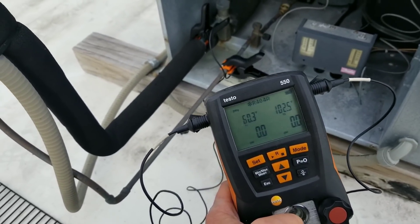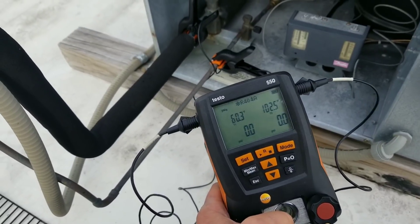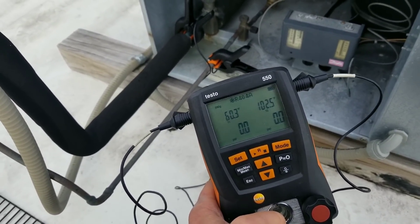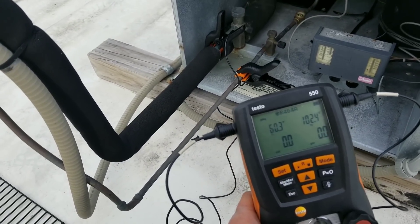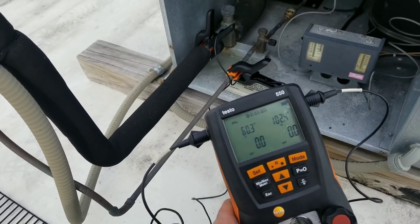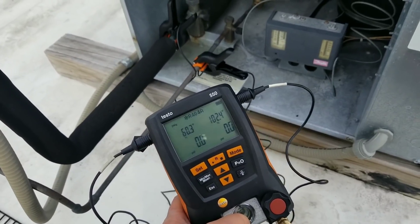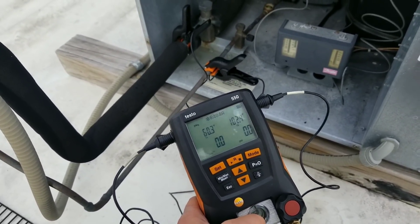This one I believe goes straight down through a wall, so I don't believe I'm running through a hot attic or ceiling. So we take that 60 degree suction temperature, subtract 20 from it, and that gives us about a 40 degree evaporator — loosely based off my math. Now I'm going to attach my gauges and see how far off my math is.